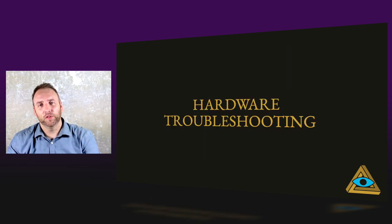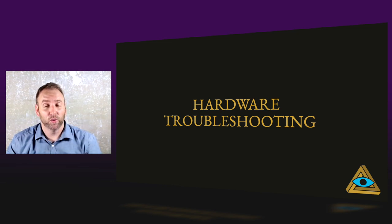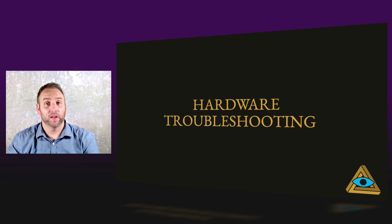Hardware troubleshooting: first, does your Arduino and the devices connected to it have adequate power? Then check the amperage. Common grounds — make sure all your grounds are put together in one spot. Continuity in the jumper wire: jumper wires are reusable but prone to overuse — do a continuity check, and if you don't hear the beep, cut it in half and throw it away. To check if a pin got fried, if pin 13 isn't working, put it into pin 12 — if pin 12 works, you know you fried that other pin. And if the Arduino isn't working, plug it into Serial Monitor; if you don't see that startup blurb, you've fried the Arduino.